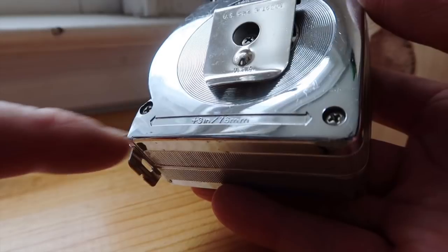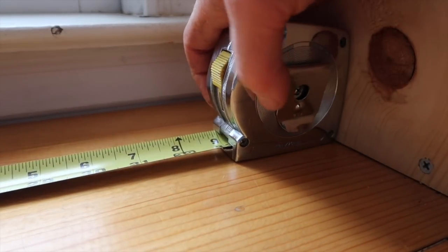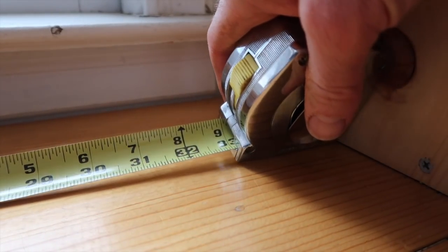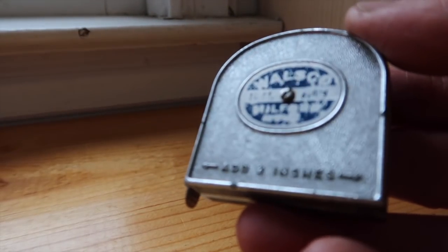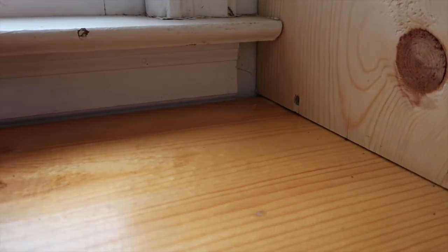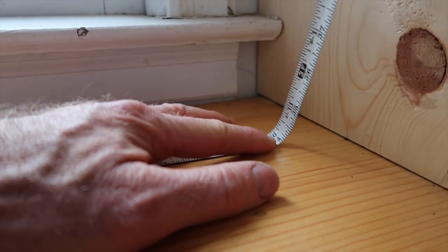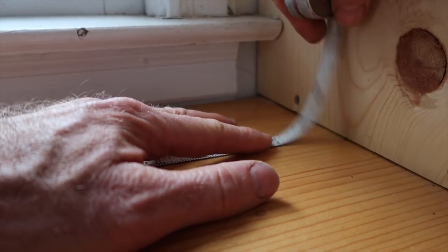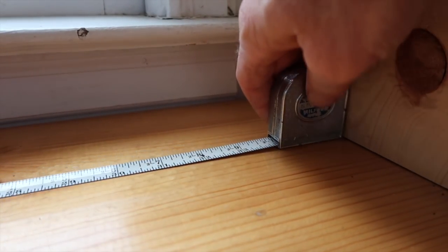This is a bigger tape measure, 3 inch measurement, or 76 millimeters if you're metric. Anyway, you lay it down, you got 3 inches on the tape. That thing says 33 inches. That means we have this 36 inch measurement. Even this old guy, this is an ancient tape, says add 2 inches straight away. Same thing, measure it up, set your tape, go to the corner, look at where you're at. It says 34, that means 36. All right, so it's a problem. It is hard to measure with a curved tape, but tape measures are already built for this.